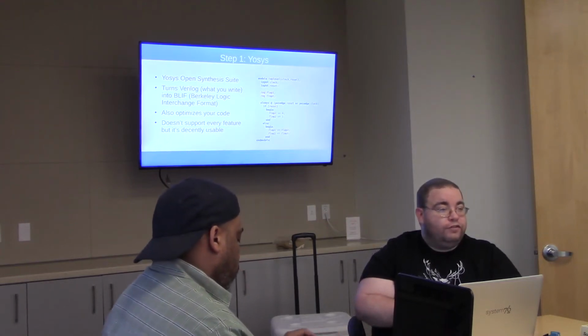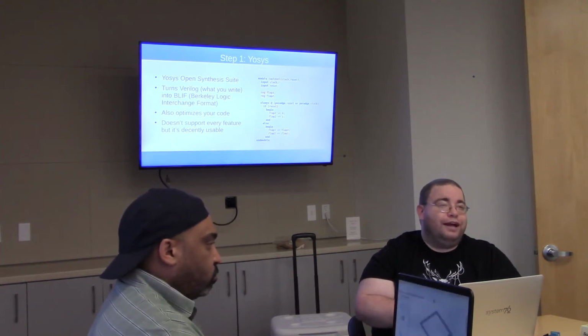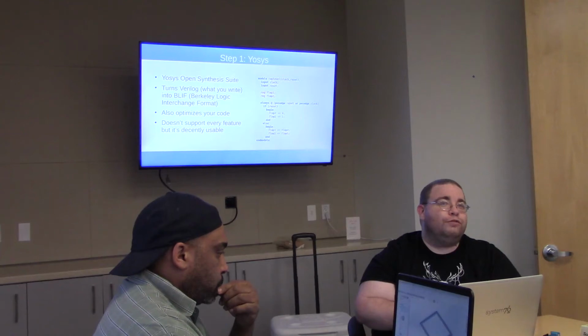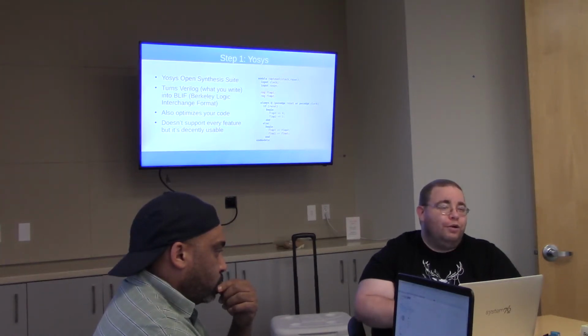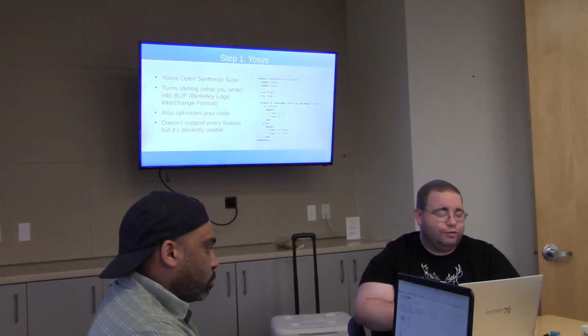There are some features that it doesn't support. I actually came across the world's worst error message the other day. Yosys's support for tri-state buffers is limited, is what it said. What I was doing, Yosys dealt with just fine. It supported what I was trying to do with the tri-state buffer, but it didn't know that, and so it warned me that if I had done something else, it might not have worked.